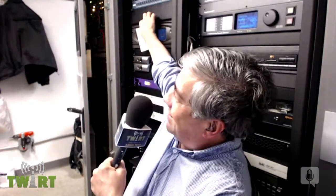That's a Dorough 310 — it's an Automax. There's an Arc Plus behind me, a little Omnia box that does some fancy stuff with the audio and creates stereo. There's an HD importer-exporter package, a broadcast devices box for the RF, BDI, and a standard tuner right above my head. Pretty simple setup — everything is measured and kept an eye on.